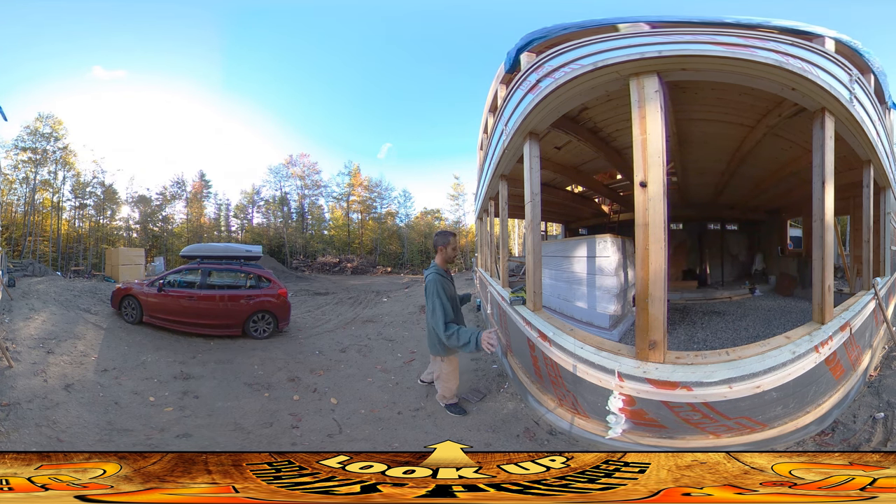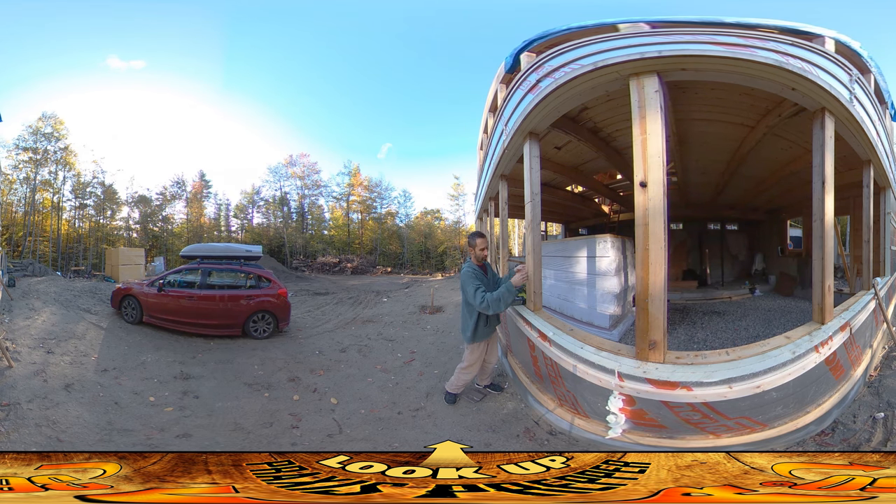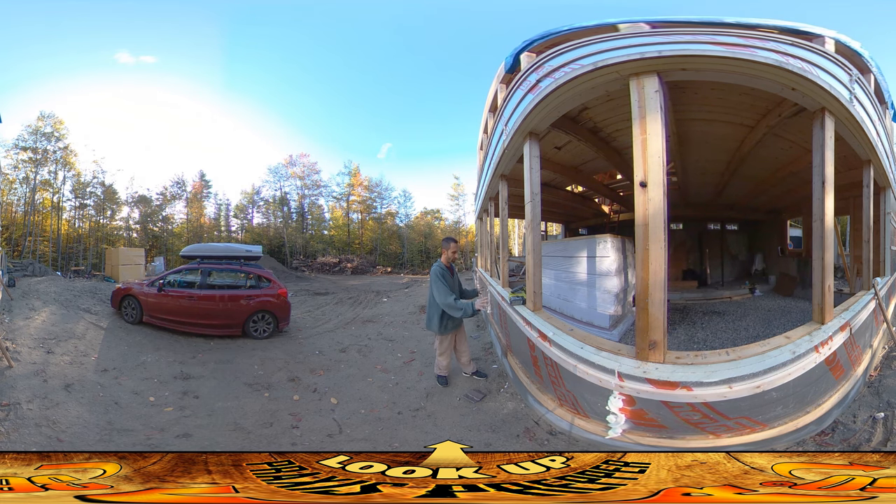So I did this yesterday. I got this level below the windows, above the windows, and on the sides. You'll notice these posts don't have any foam on them — they are going to get foam, I just didn't do that yet. There's a little spacer board here, a three-quarter inch board to get the outside surface flush with the rest of it. There's going to be two inches of foam here, then some boards holding it down. This strapping has nails that go into every post — these long eight-inch nails. On top of this, there'll be vertical boards screwed in vertically. They gave me nails with the kit, but I like using screws — I feel like they hold better, and if I ever need to pull the boards off to get at anything later, it'll be easier.